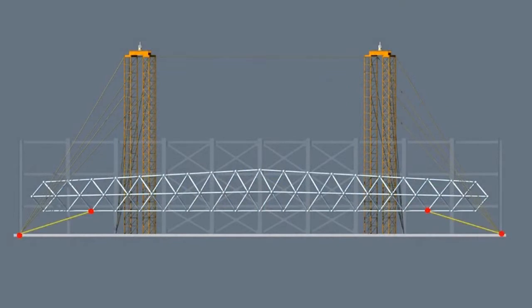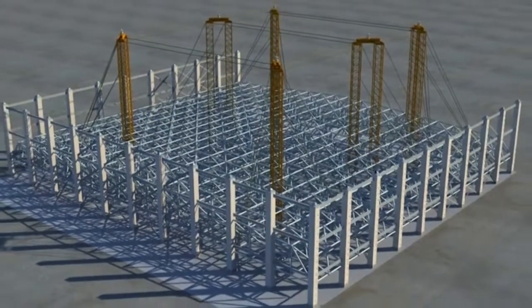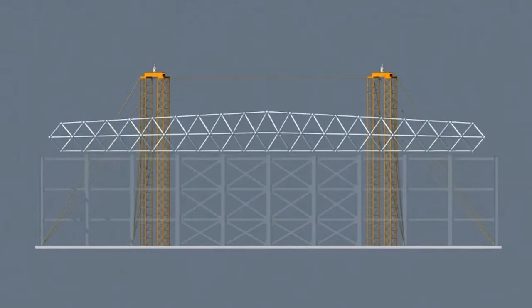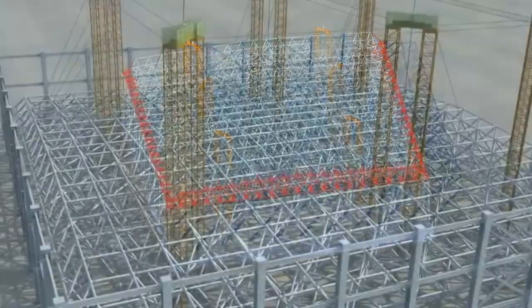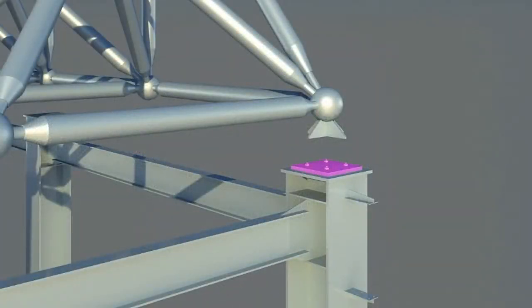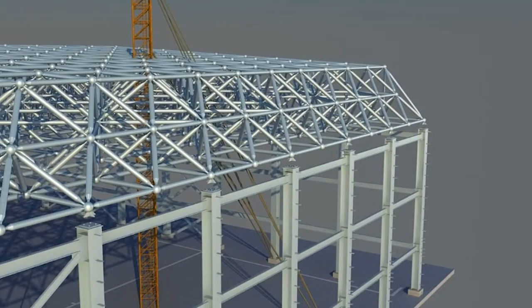In bad weather, the 4 corners of the spaceframe should be fixed in position by additional chain blocks and the power supply should be shut down. Step 3: After the checking and inspection of the works is done satisfactorily, the lifting of the spaceframe will be resumed. Throughout the lifting process, two sets of tie wires will be in use alternately. The spaceframe will be lifted until it is 100 millimeters above design elevation. Step 4: Installation of the remaining members and supports will take place along three sides of the spaceframe with two elevated working platforms and a 25-tonne mobile crane. The baseplates of the spaceframe supports will be installed to the top of the steel columns first, and the stiffeners are also prefabricated to the spaceframe. Side welding will be carried out for the connections between the stiffeners and the baseplates.